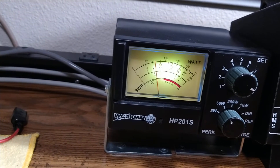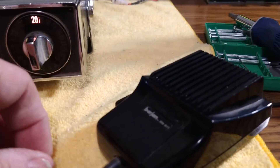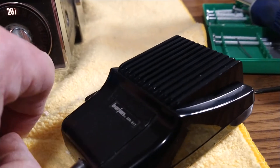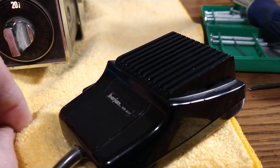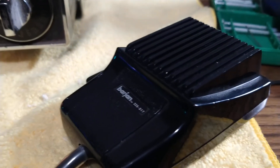Hello, audio check — about 15 watts. The microphone seems to be working good now. There was a capacitor in there that was loose; I soldered it back on the little board, and everything else seems to be working good on it.